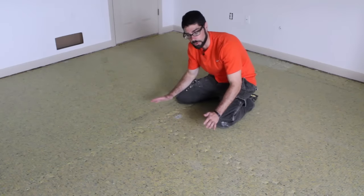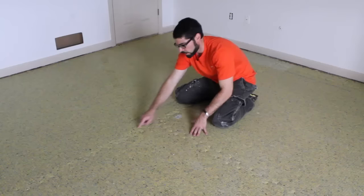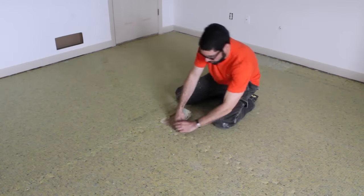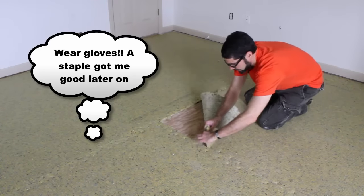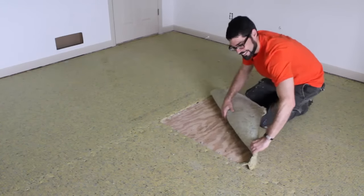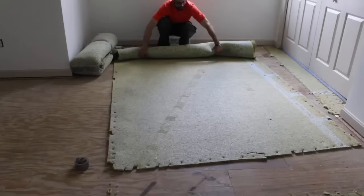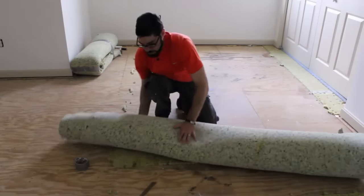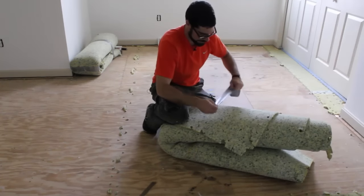What you're left with is the padding on the floor. Padding is just tacked down, most likely with staples, and the staples are only along the perimeter of the padding. All you need to do with your fingers is pull back and remove the padding. Just be careful — you may want to wear gloves because the staples, if they come up into the pad, they can jab your fingers. The carpet padding is pretty flimsy, so you can roll it up easier than the carpet itself. Fold it over on itself and use duct tape to secure it.